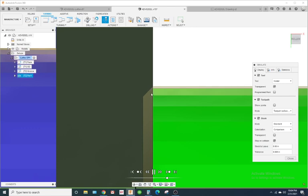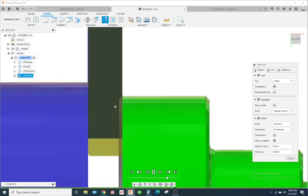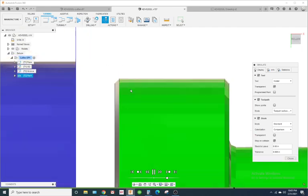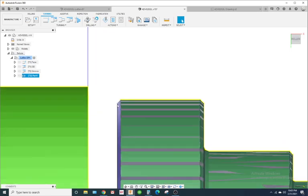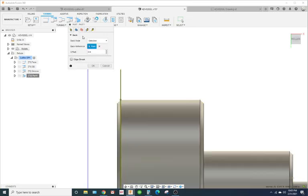Alright, see, that's a problem right there. Now, a lot of times, writing programs, you just have to know what to look for. And that's just from experience. You just have to write programs, and you go run it, and you run into little problems like this. Your part would be short. You may not even cut that. You'd be like, man, why is my part coming out short? You may reset the tool and sit there and look at the code and jack with parameters. And the whole time it was because we selected this line right here. Let's see if we can fix that.